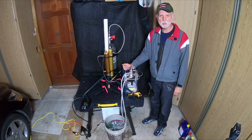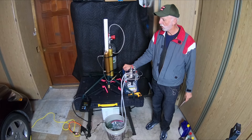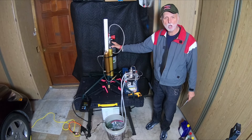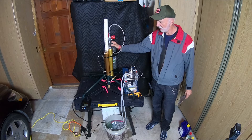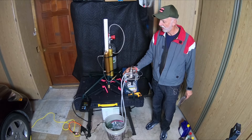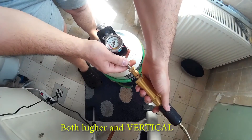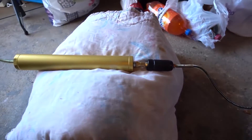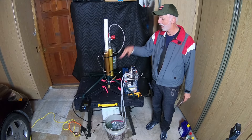A couple of safety things I should mention: you don't want water getting inside these metal assemblies. Although it's a carbon fiber tank, it does have aluminum on the inside, and you don't want water around these things. Keep your filters up higher than the pump, and keep them vertical — if they're sideways they won't do anything. They're meant to operate in a vertical plane. If you put them on their side, you might as well just bypass them.